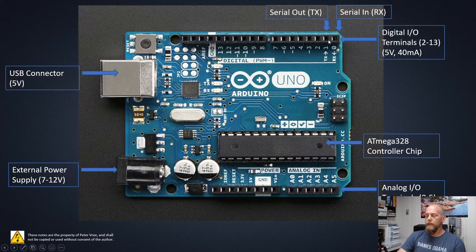We have serial in and serial out on pins 0 and 1, so we'll use pins 2 through 13 for all our projects. Then we have the digital ground, which is available here and also down here — there are three different points you can pick up your ground. So those ground points are kind of the return for all of our circuits.